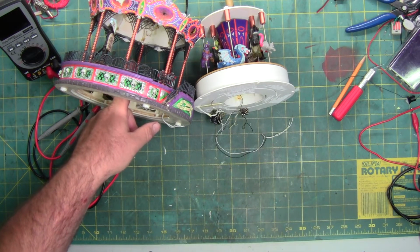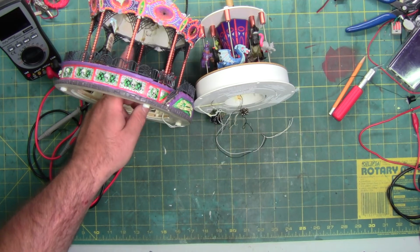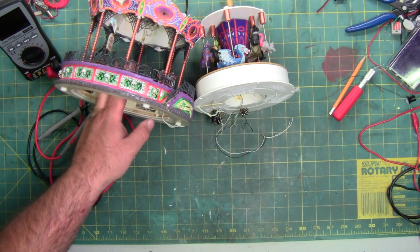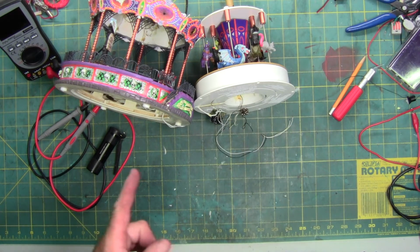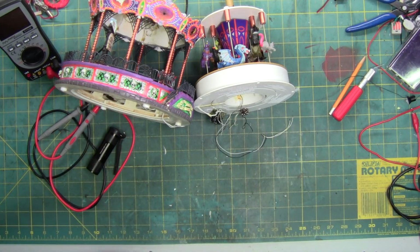As far as this goes up here, I thought it was just one burnt resistor. There's three. Three other resistors are burnt. One of them doesn't work. The other two still have good resistance within the bands, but they're probably burnt because they're all glued together. So when the one got really, really hot, it started melting the ones around it, of course. And the hot glue that it's glued in with started to separate as well. So I'm going to have to replace, I don't know, 5 resistors, maybe 6, to get most of this working.